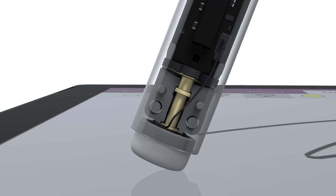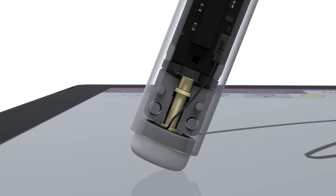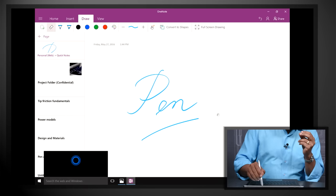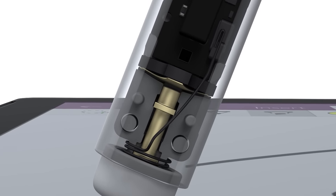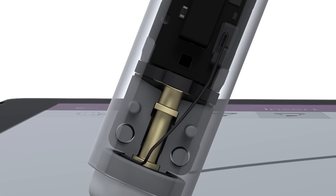This was quite an engineering feat to design. First, we created a 20 micron movement switch to trigger a capacitive erase. We augmented this with material treatment to make it feel perfectly like an eraser on the screen. Secondly, we needed to provide sufficient force to fire for it to have a positive feel as a clickable switch — one which would not accidentally click while erasing.